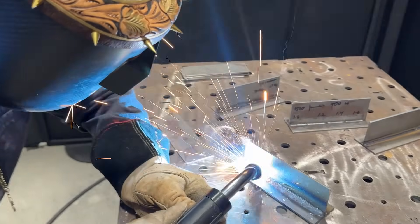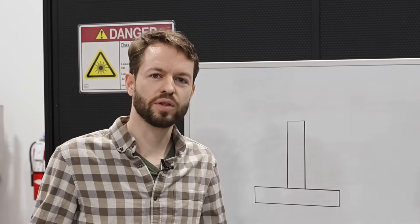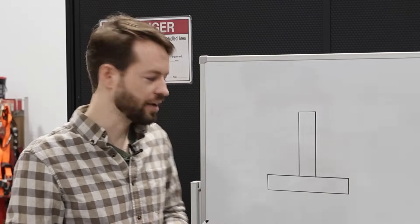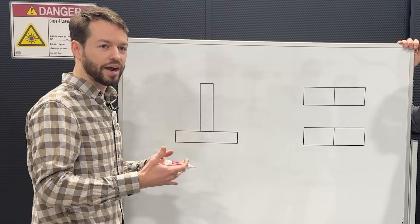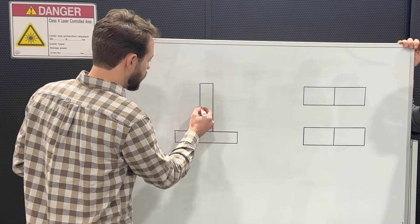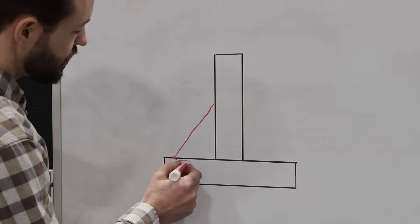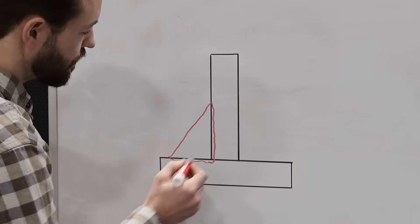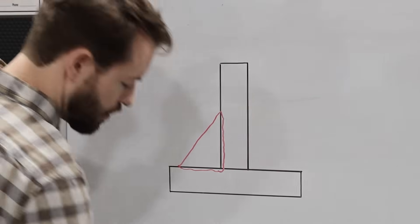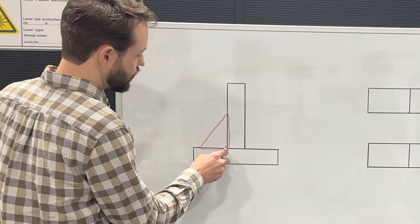Penetration is going to be key to laser, but compared to MIG welding what is the biggest thing to look into when it comes to a fillet weld? All of our strength when we're laser welding comes from our depth of penetration — this is what makes lasers unique compared to arc welding. When arc welding and laying down a MIG weld, you can cram many inches of wire into one inch of weld, so you'll have a fairly large fillet on the outside. Cross-section it and you'll typically see you penetrate somewhat into the parent material, but not too deep, and all of your strength from your MIG weld comes from the throat of your weld — the shortest distance from the root to the face.